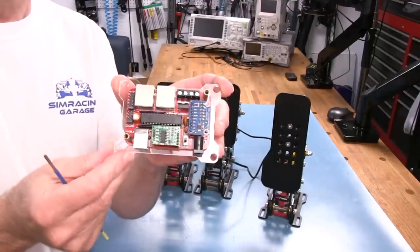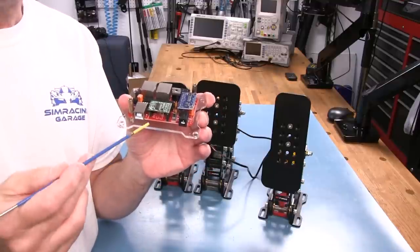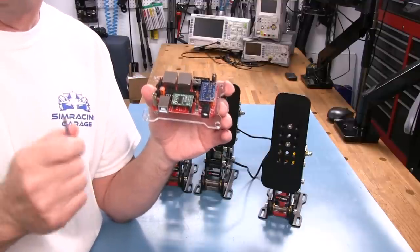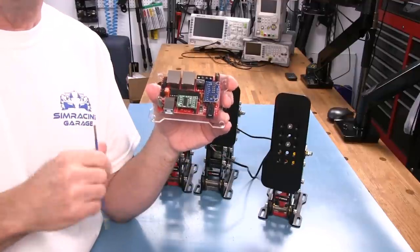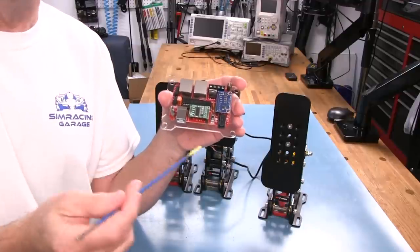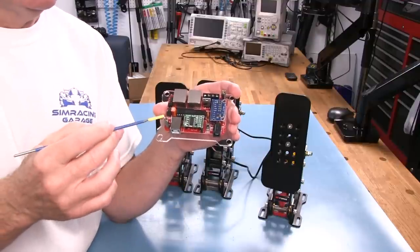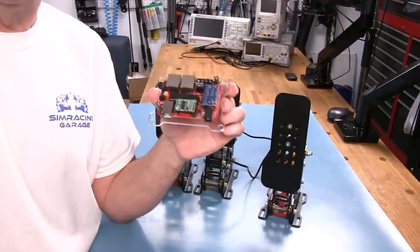I mentioned in a lot of videos that manufacturers need to start taking more care and pay more attention to this issue, because more and more people are now in the market, since the market has come down on price points for direct drive wheels, which are servo motors, and they obviously emit EMI. Electric motors do that. They're very good at it, actually. And it can interfere with your electronics, at the end of the day. Even just a single servo motor on a direct drive force feedback wheel can play havoc with a load cell or some other circuitry in your shifter, whatever the case may be. Maybe even in your button plate, where the circuit board is, or whatever you're using inside of your button plate. These things can be affected, and the results are like ghost shifting, all kinds of weird things can go on. So Simforge have taken it on themselves to try to mitigate that the best they can.